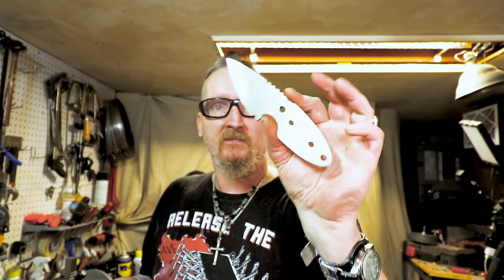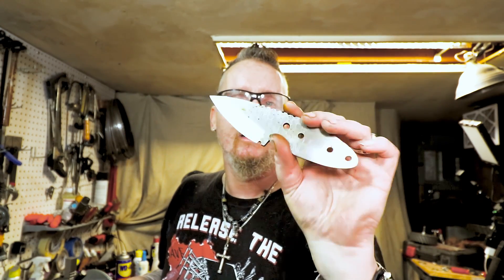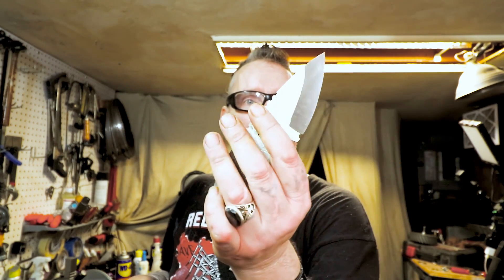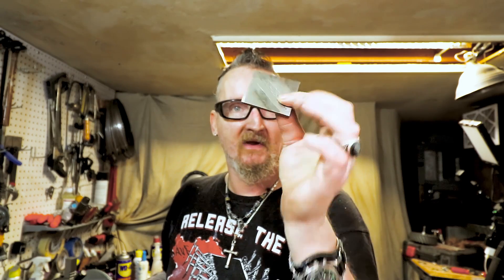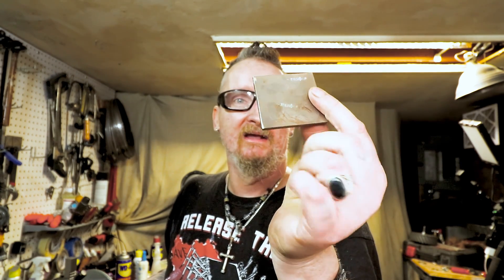He first asked me to not wrap this, but I told him we're going to have to go up to 1950 Fahrenheit, so the decarb that's going to build on this might make it useless. So he actually sent me a piece that he etched and we're going to put this in with no wrap to see what it looks like. I've never done stainless with no tool wrap, so we'll see what it looks like afterwards — pretty interested myself. Let's get these things wrapped.